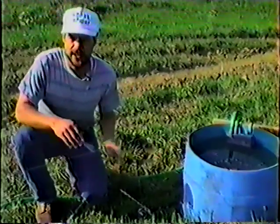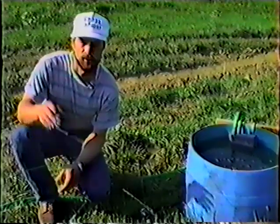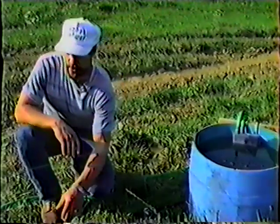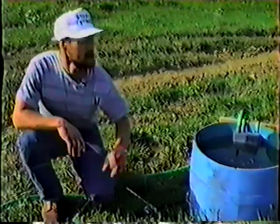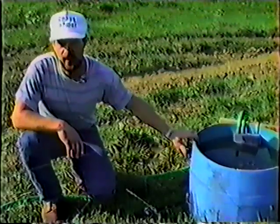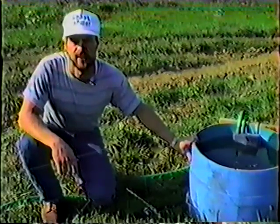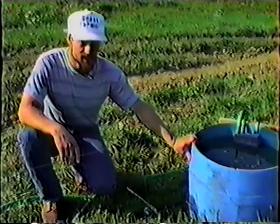One advantage we have on this particular farm is that our water hydrant is at the highest point of the farm. So that way we're able to run water downhill all the way to the back paddock of our farm, which is a half mile away. So we're running water through this pipe over a half mile to the back paddock, simply using gravity.